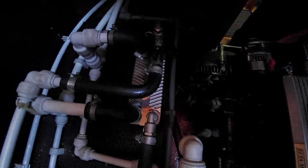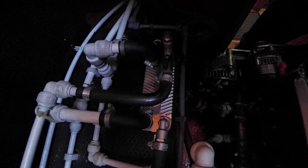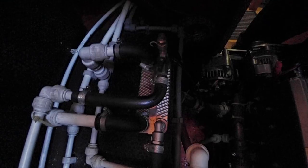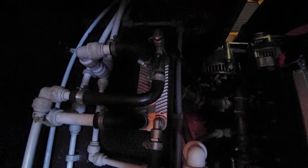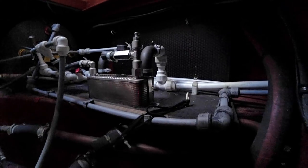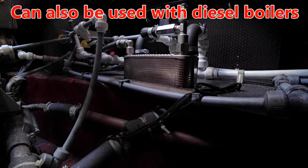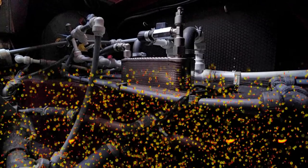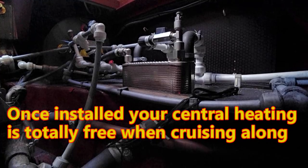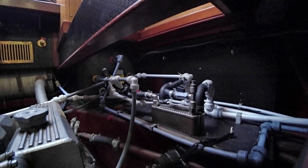It's a nifty bit of kit. I've put it into the central heating system - it's split in the middle with little coils for heat transfer on each side, and the heat just transfers over as the engine gets hot. You put your central heating pump on - in our case a very low amp pump - and the water works its way through. I'll show you from underneath so you can see just how small it is, but it's a stunning bit of kit. It handles both the hot water and the central heating with just the pump going, and because we cruise in all weathers we have that on quite a lot.